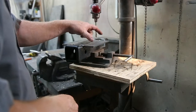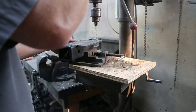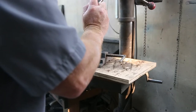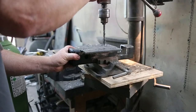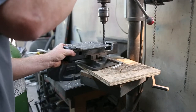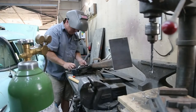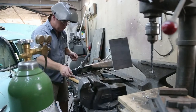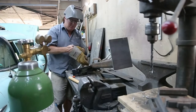I also marked up the holes here for the U-bolts — they're 3/8, so we're going to drill it one size bigger; we don't want to have to fight. Time to tack her together now. We want to make sure everything is nice and straight. We don't want to weld it all together until we know for sure this is going to fit and bolt up — it's easy cutting a tack off but it's tough cutting the weld off.